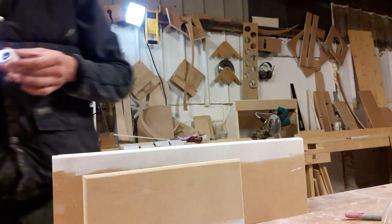I'm going to use a magnifying glass to show you what's going on. This is the piece that has just been cut on the table saw and routed — you're looking at the edge, the face edge and the routed part. You can see it's pretty furry and knobbly. That last bit I showed you has actually been sanded the first time, so you can see it's still not totally smooth even after sanding. Don't waste too much time trying to get it really smooth because you won't be able to.